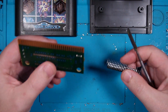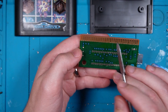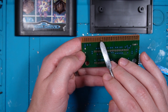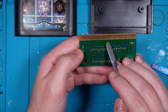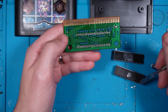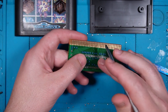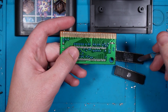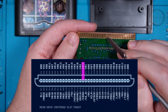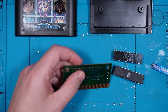I've had a look at the pinout for the cart and the mask ROM and the EPROM. What we're looking for is pin A16 — counting to pin 16 — which is this unpopulated one, and that is address line 17 on the cart connector, which confusingly connects to address line 16 on the ROM. That's just because the ROM and the cart are offset by 1, since address line 0 in the system is always ground — they start at A1, but it's actually A0 on the ROM, so it's just offset by 1. A17 connects to A16, and I'm going to do that by hooking up a wire from that pad to this point on the PCB, and I'll have to cut that line first.